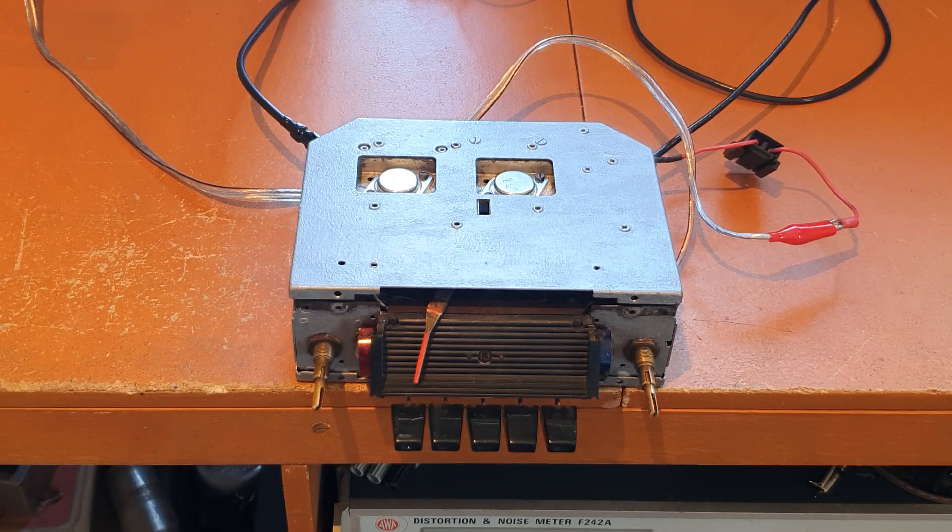There are both ceramic and polystyrene capacitors in this radio. The polystyrene ones were put in to promote stability — all the good things those capacitors were meant to give you. It didn't quite work that way with this radio. They're everywhere in the RF section — across the IF transformers, throughout the local oscillator. They're meant to be really good, but some of them are not, and it's the way you measure them that causes the interesting anomaly.